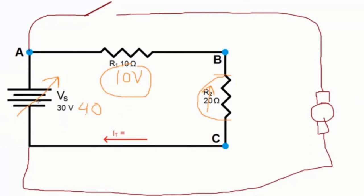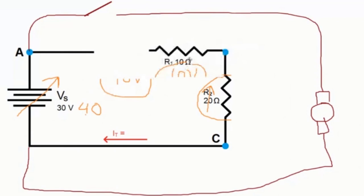And what happens actually is that the voltage, the power of this, the pressure coming out of here lowers. And there's actually going to be less than 30 volts. This may go down to 27 volts because this is stealing so much of the energy from here that these guys aren't going to get as much energy. But I do not want this to dim. It's a lamp and I do not want it to dim.